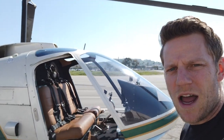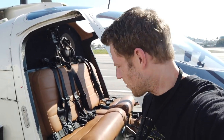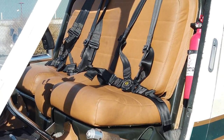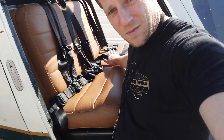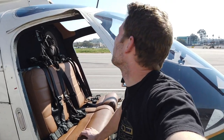The cabin is one of the big reasons why I bought an Enstrom. If you take a look in here, there's a three-seat bench. The pilot sits on the left side, which is a little unusual — helicopter pilots often sit on the right side. The reason is that the collective control is on the left side of the pilot, so putting the pilot on the left means there's space in the middle for two occupants. My daughter sits right here in the middle, and my wife can sit right here. I can absolutely fly with two other adults — it gets a little cramped, but it's workable.